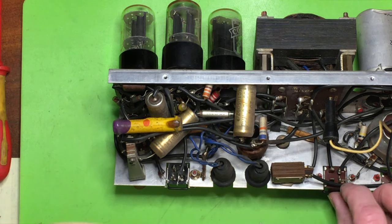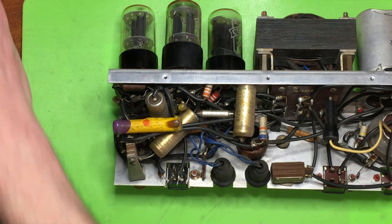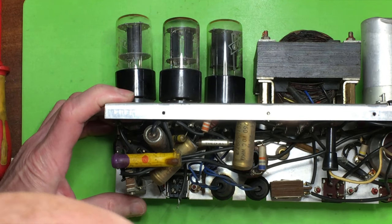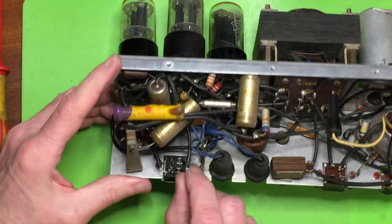So I'm going to use pin 3 for audio ground, which is ground on the power connector, and pin 4 for audio in and out, as that's not used in the mains cable. So if someone does, for whatever reason, connect the two together, it's not going to cause anything catastrophic to happen. Right, so pin 3 is that one. Pin 4 is that one, the two front ones, that's quite convenient.